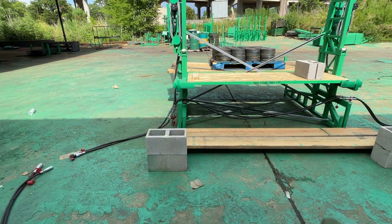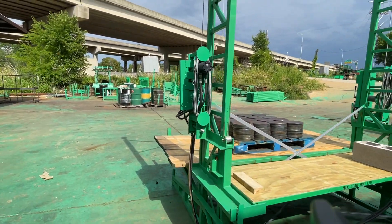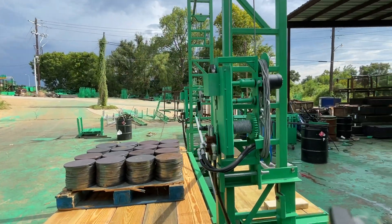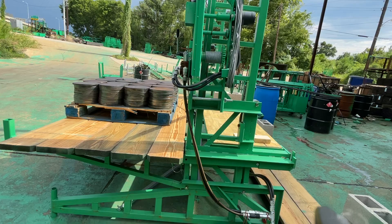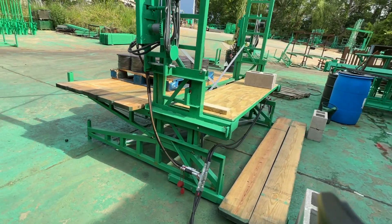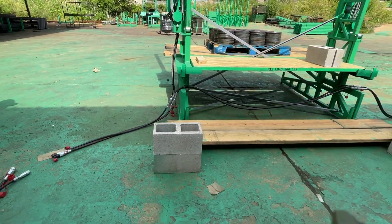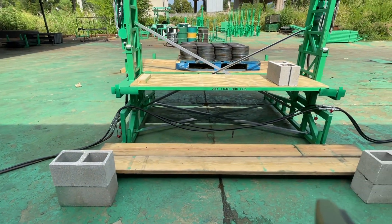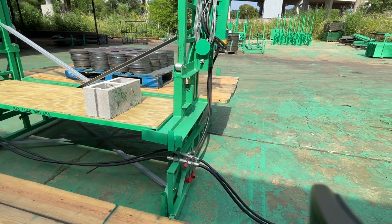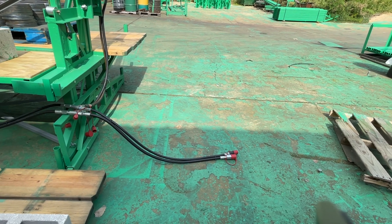Here today we have a quick look at our new motorized non-stop scaffold. Each winch will have its own hydraulic motor and up-and-down control. The hydraulic hoses from each winch come down and connect to this trunk line — as we're calling it right now — which starts right there, goes underneath the mason's material boards, hooks to the other winch, and then either goes to the hydraulic power unit or to the next scaffold.